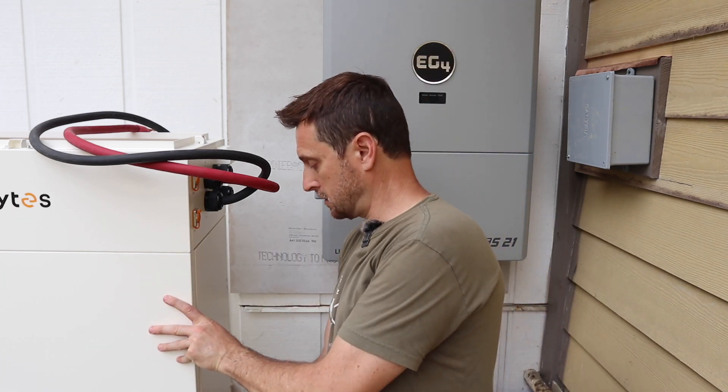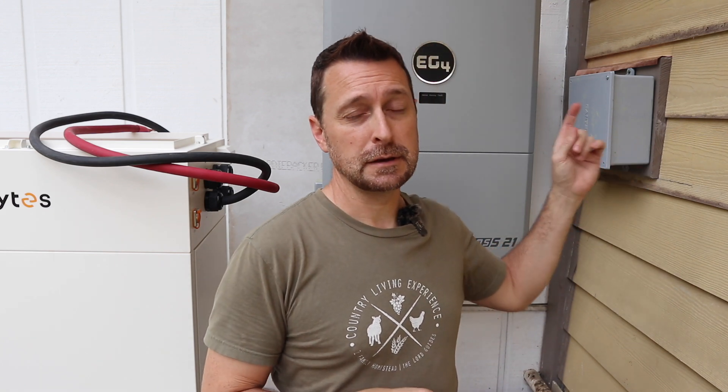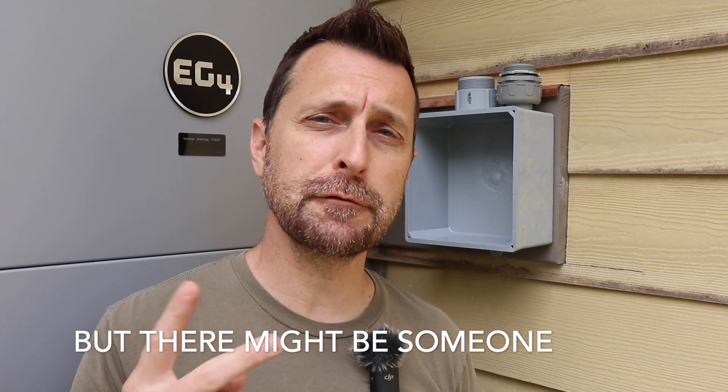Now that we have the Pites box completely wired, after that comes the fun part of drilling through the side of the house and connecting things into our sub-panel, which is in our solar room. Regarding communication: if you want your Pites batteries to communicate with your Flex Boss, that will work — they work seamlessly with each other. However, if you want your other batteries to communicate with your Flex Boss, you need to connect those instead of the Pites box. Each battery brand has its own BMS and communications protocols, and you cannot connect two types of batteries with communication to the Flex Boss — it's either one or the other.